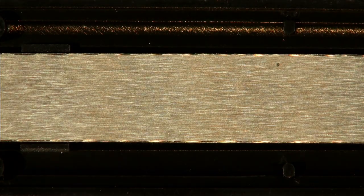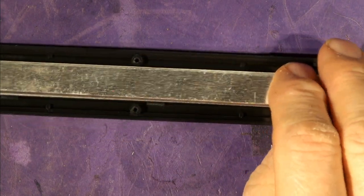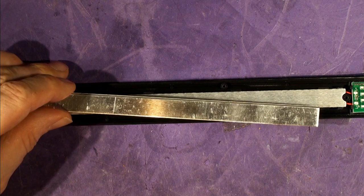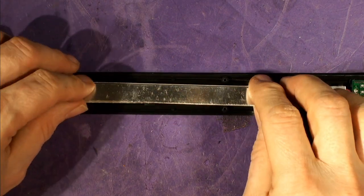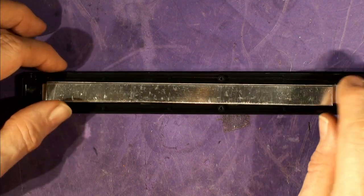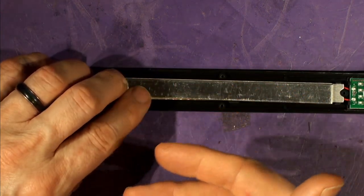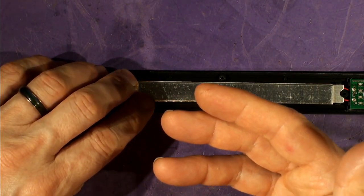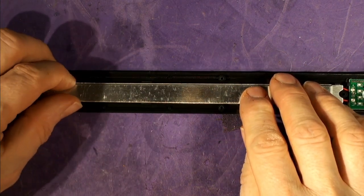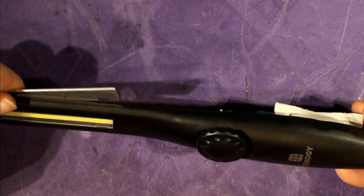The aluminum heat strip on the back of the LED strip helps with thermal inertia — it absorbs heat and evens out any hot spots across the LEDs. It won't radiate much more heat but it will slow down the temperature rise considerably. High-power LEDs, when driven hard, show a measurable power drop very quickly as the junction heats up. Now let's look at the Eye Shield. Same disassembly procedure — loosen the screws.